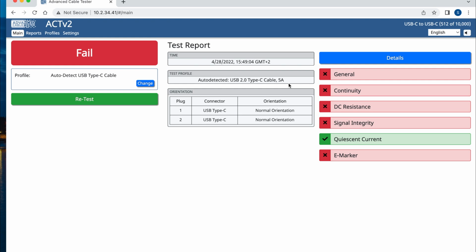One interesting thing that I found with this tester is, for example, there is a difference when you flip the USB-C connector. It's a logically different connection. I thought the channels were duplicated or like crossed over, for example, so that's how you could invert it, but apparently not. There is a difference. And you can see I've just tested the USB-C cable that Apple sends with the device.